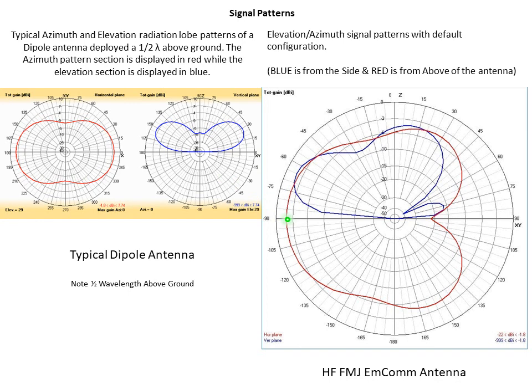Now I think for POTA this doesn't have much significance, because it seems that the contacts are kind of randomly dispersed around your location, so being stronger in one direction may not have a lot of value to you, with the possible exception that if you set up the directional radio so that you're pointing east, and we're fairly close to the Atlantic Ocean, you might be able to pick up Europe a little better. But there again, it's not easily quantified, just more general tendencies. But like I said, this is just something you could take a look at to fine-tune your understanding of the antenna even better.